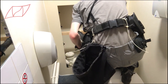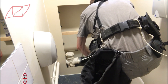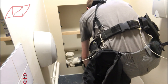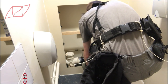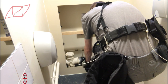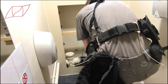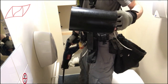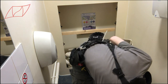Most of this job you're just going to see my backside, but it couldn't be helped. The angle grinder does a good job of cutting soil pipe — it's what I use all the time if I can. Obviously there are situations in a tight area where you have to use a reciprocating saw or even an old-fashioned wood saw, but I tend to find this is the most expedient and still the neatest way. You can cut a pretty square bit of pipe with no issue at all.